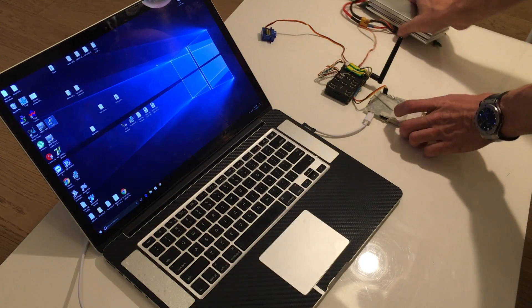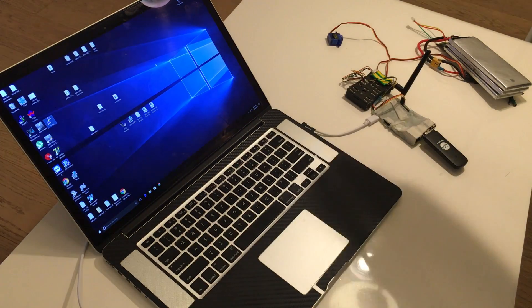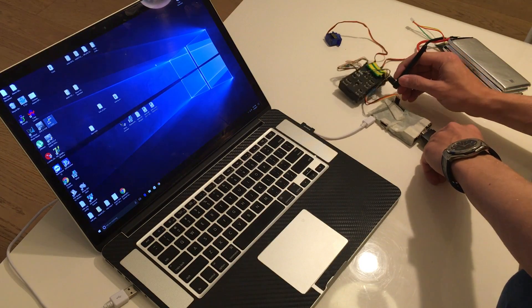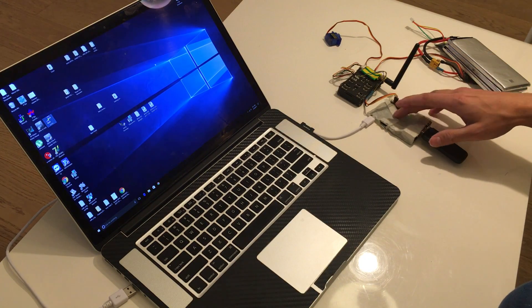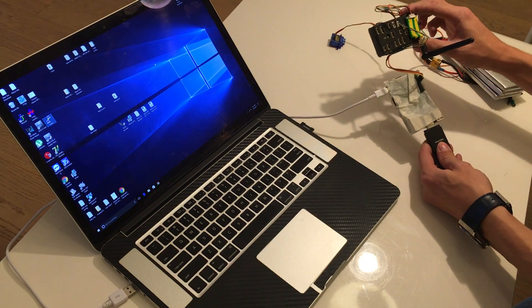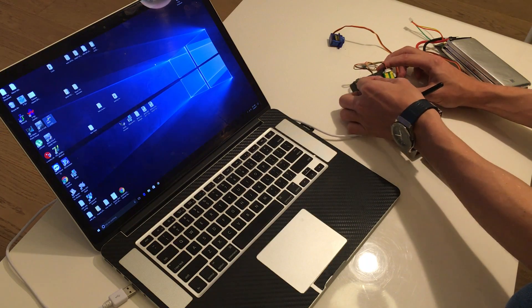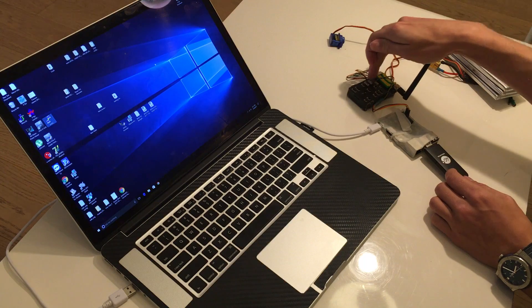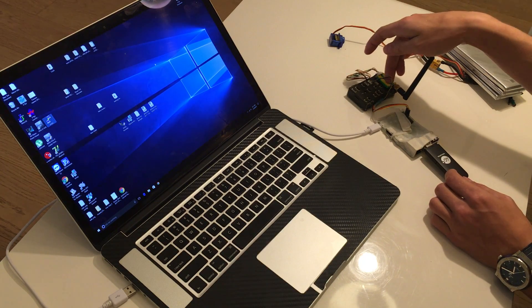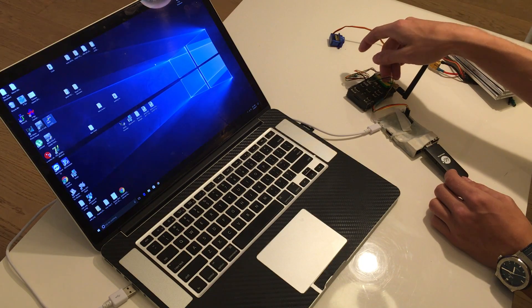Here's a small overview of the system. We have a Raspberry Pi 3 connected over serial — a single cable going through the serial port, which I was able to activate properly. It runs into the telemetry port of the Pixhawk using three wires: two signal wires RX/TX and a ground wire.